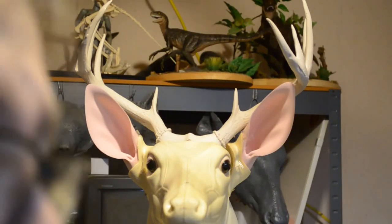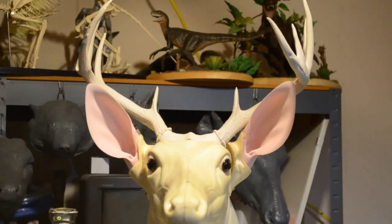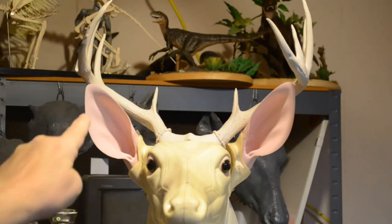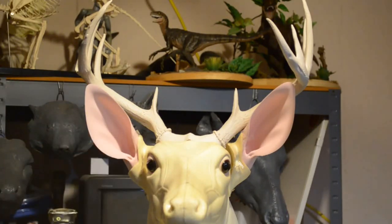There's two ways. You can mix up some sculpting epoxy. Try and match the color or not, it really doesn't matter. Lay the epoxy in the area to be repaired, to fill. Take the mold, powder the mold, and after the epoxy sets up a bit, wrap the front part of the mold around that antler burr and sort of form it. Trim away any excess. That's one way.